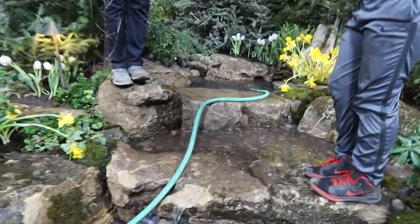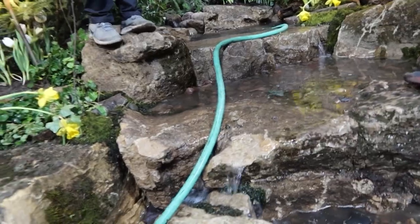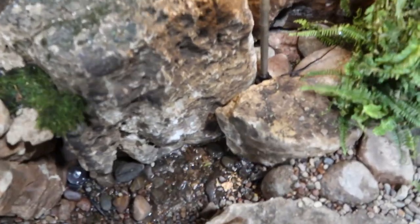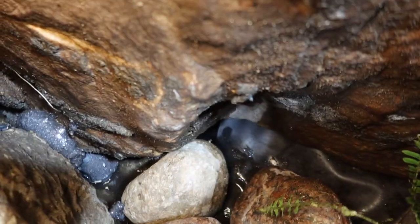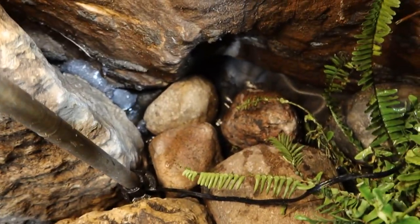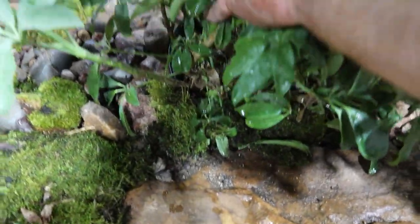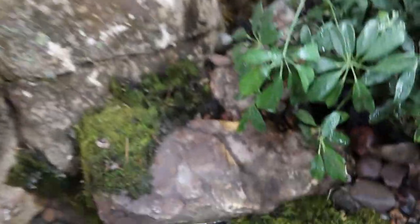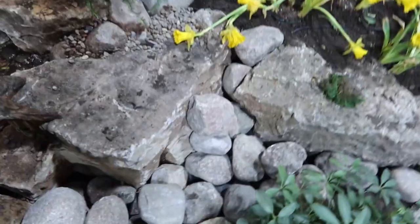We just got the garden hose filling things up - you can see things are pretty level and with garden hose pressure we're getting a lot of water just to come over the top of the rocks. But remember that weep hole we were talking about - look at this. We've got a pretty decent trickle of water moving through this area here, coming out right where we knew it would. So we could do two things: we can just accept the fact that our controlled leak is working, or I could come back up in here and try to figure out what I didn't foam. The way things were finished up here we really intentionally tried to keep edges close, so it's probably just trickling underneath this rock and going through all that gravel. The good thing is at least the water is leaking where we want it to go.